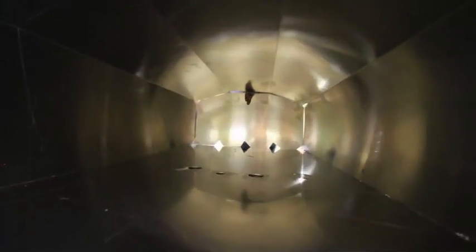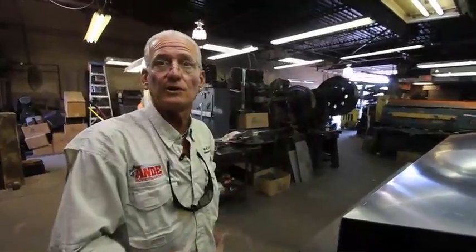Now you can see, looking at this baffle, how it will prevent rapid movement of fuel, but the fuel can filter through those little gaps that are built into it and slowly equalize its position in the tank instead of sloshing down to one end and creating all of that momentum of moving liquid in your boat.